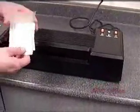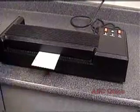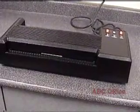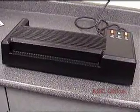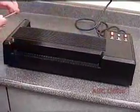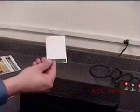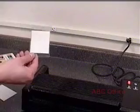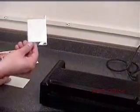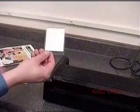I do have a smaller carrier — again, remember to use the carrier every time. Just place that inside. The laminator is already heated up, so just turn the motor on and run it through. Another problem I've seen when people don't use carriers is that the lamination film will actually get wrapped under the rollers and jam in the machine, and in that case you have to take the whole thing apart to get it back out. Because it is smaller, it does run through the laminator a lot faster. Now, if the lamination film is cloudy, that indicates the laminator is too cold and needs to be turned up. If the lamination film appears rippled or bubbled, it's an indication the film is being run through at too high a temperature — the glue on the inside of the pouch is actually boiling from the heat, causing those bubbles and ripples.